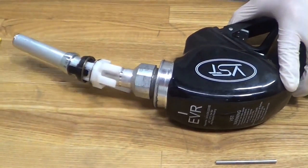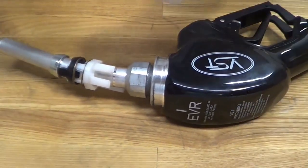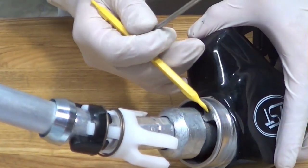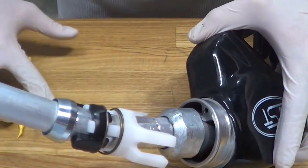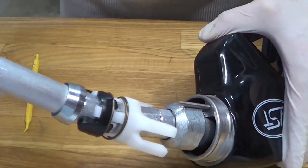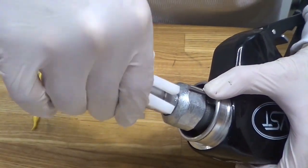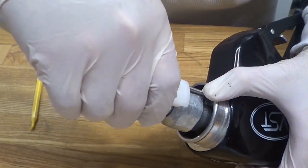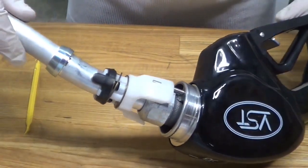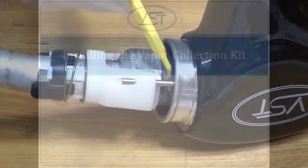The spout should be tight and not able to rotate. Do not over-tighten the spout nut. After tightening the spout nut, place the interlock rod into the hole of the nozzle casting. Move the sleeve in place so the interlock rod is inserted into the recessed hole on the end of the sleeve. The interlock rod may be compressed into the nozzle to ease the insertion. The interlock rod should be visible through the side hole of the sleeve.